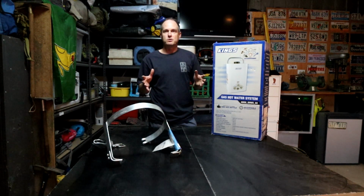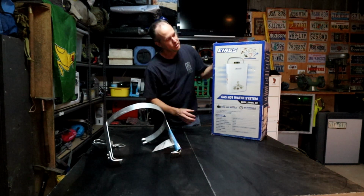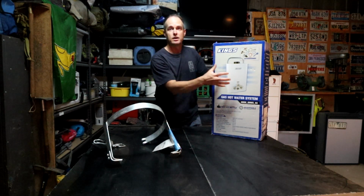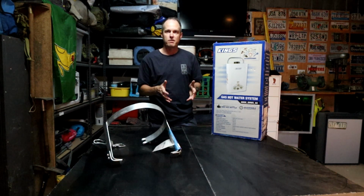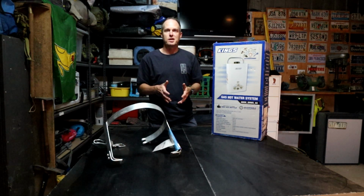But all that you would need to install in your caravan is a place to hold a 9 kilo gas bottle, and then the gas fitting that runs to the water heater is just like the one that you would have on your barbecue. So there's no permanently installed gas fittings on the Caravan, which means that you don't need any certification from a gas fitter.